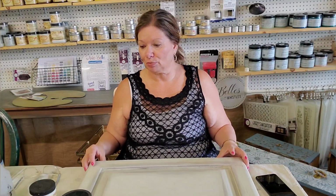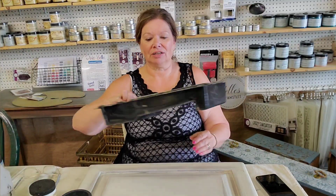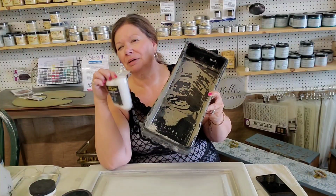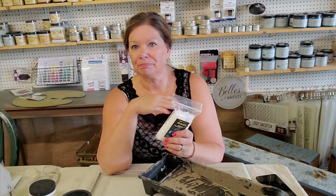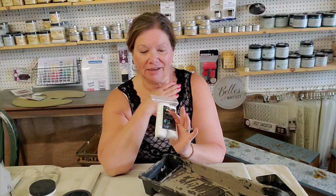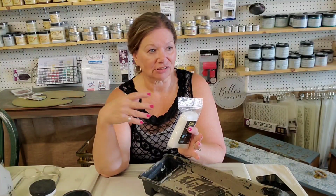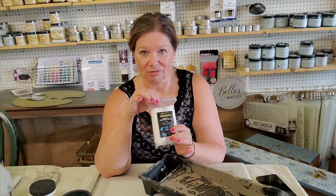And what do you use as far as if you're not going to spray? Do you use a brush? Do you use a roller? I used to hand brush everything because I do love to paint. But now I use a roller, and it's really made my life a lot easier because the more kitchens I paint and the bigger the jobs, if there's a lot, I prep for it, and I just set up my shop, and I have long tables, and I just lay out all the doors, and I use rollers.